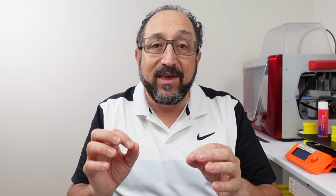It assumes every printer is in essence perfect, but they're not, and they're not even close. Now, there are a couple ways to tune the extrusion of filament. The primary areas that you're going to tune are the ability of your printer to hold temperature. That's called PID tuning. There are videos on the channel about that. In addition to tuning temperature, it's also important to tune the extruder. How much should it turn each time it needs to extrude filament?